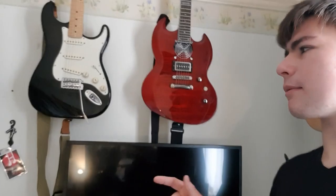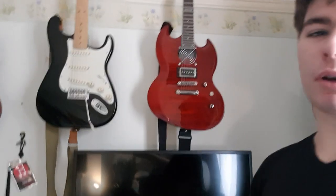I played the gig with this last night, but I only played like 10 minutes with it because there's something wrong with the input. The signal kept on cutting out, fading out, and then coming back again. Weird one. Sounds really good, but I can't move around with it. So it's probably something to do with the jack prong that touches the connector, but I'll have a look at the soldering at some point and revisit that, and then I'll update you. Bye! Here's what actually happened.